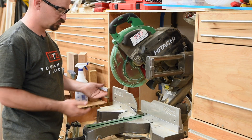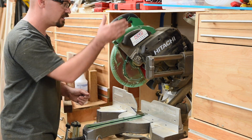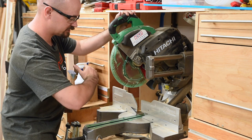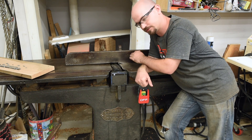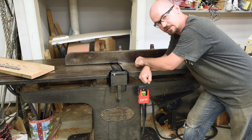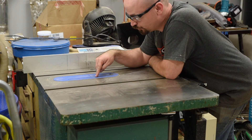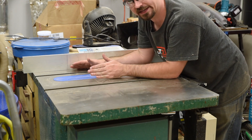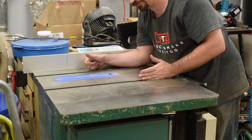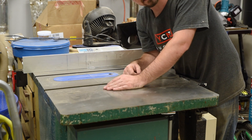It's normally not very hard and it's pretty straightforward. At your miter saw, you want your cuts to be square, so your fence needs to be square to the blade and the head needs to be at 90 degrees. On a jointer, your beds need to be parallel with the cutter head so it's flat, and the infeed and outfeed tables need to be co-planar with each other. The fence needs to be square to the infeed table if you expect a square edge. At your table saw, you want your blade parallel with your miter slots and your fence — that's important to prevent kickback and ensure you're cutting the dimension you think you are.